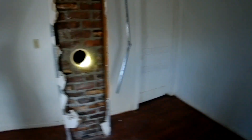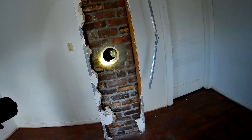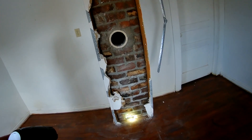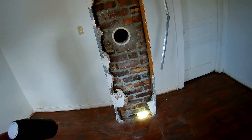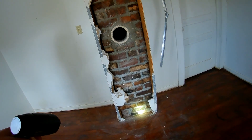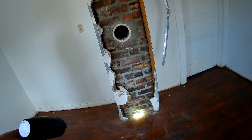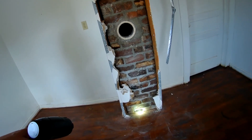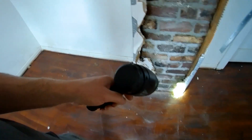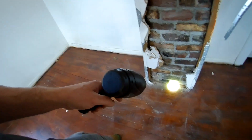I'm going to get rid of this — probably have to just start knocking it down a block at a time, see how that works. I know there's a concrete block under the house, so I'll probably have to get a wrecking hammer, a jackhammer or something along those lines. I don't know the shape it's going to be in under the house and how high it comes up, and what is actually being used for structure. I think that stud and that stud they added into a box around this fireplace are actually sitting on top of the concrete, which I think is right there.